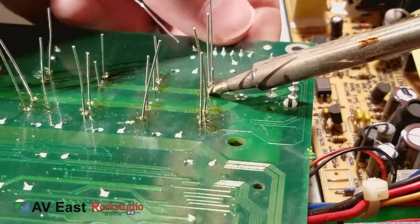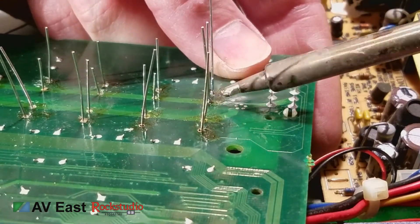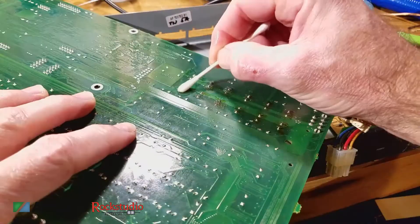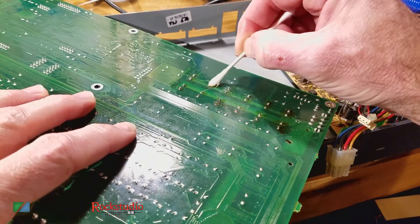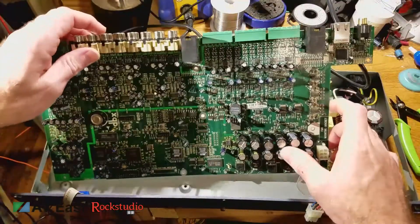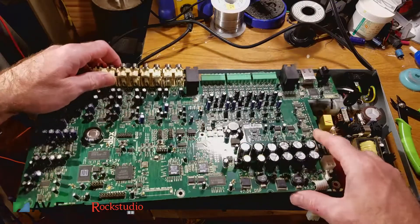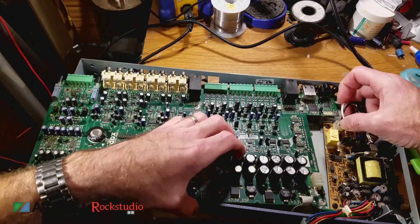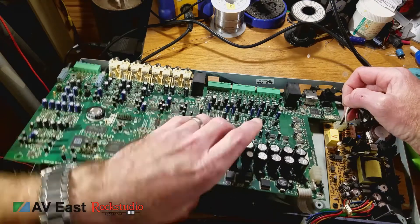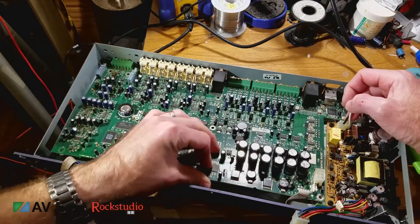It's a little tricky to hold the capacitor flush against the board while you're soldering it in. If you have another person there to help, it'd be a little bit easier. Repeat that process with the cotton swab and alcohol to clean the rosin off the back of the board. Now reassemble everything. If you saved your program, you can hit that CPU reset button that's on the circuit board and see what happens. It might clear away some of those error codes — you'll probably have to reload your scene, so make sure you have it saved before you do anything like this.